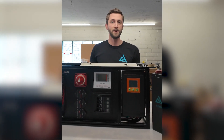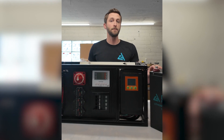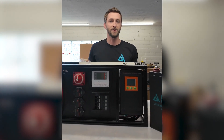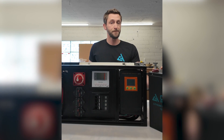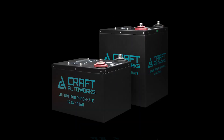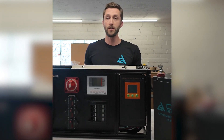One of the really critical details that often doesn't get discussed is the amperage output of the lithium batteries. Lithium batteries all have what's called a battery management system, the BMS — a little computer inside each battery that tracks voltage, amperage, and temperatures, making sure everything stays in safe operating zones. The BMS has a maximum current output, which is how much power it can consistently put out. For our 100 amp hour batteries that's 100 amps, and for our larger 230 amp hour batteries that's 150 amps continuous output. This matters when pairing a battery bank size appropriately to your bench built system.